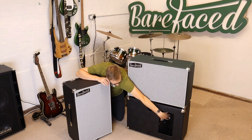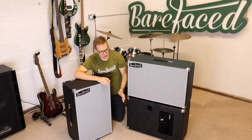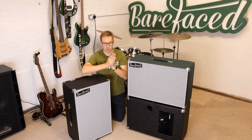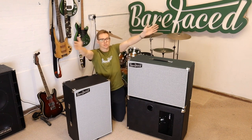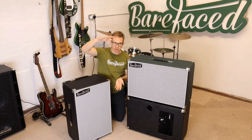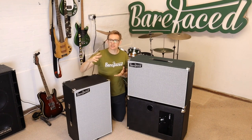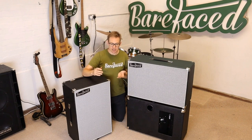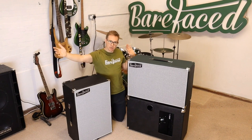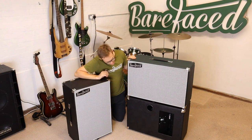So we're trying to help you when the room acoustics aren't in your favour. This augmented vent diffractor on the Radical is only behind one of the speakers because we're trying to optimize the dispersion pattern. What we want with sound is to have wide horizontal dispersion because rooms are wide, and we want enough vertical dispersion because obviously we're taller than the cabs and people are at different heights, things like that, but we don't want masses of vertical dispersion really, because that just ends up in lots of floor and ceiling bounce, which tends to muddy the sound whilst walls are further away, so the reflections are later. They don't cause such a muddying effect.